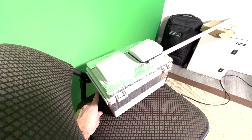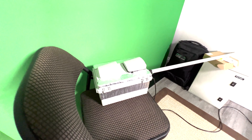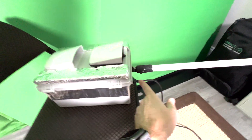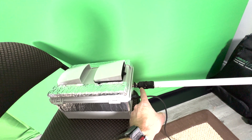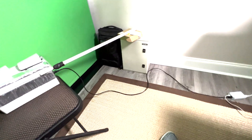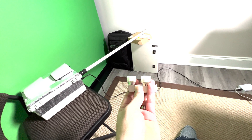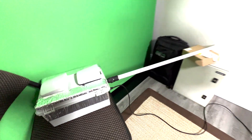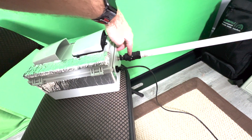That's assuming you don't mount it in a shaded area, but for me these are on telescoping masts so they're literally just up there. On the later builds I've done all the holes I drill on the bottom, then I use LMR-600 cable and just come around and go up to the antenna. You can get 90-degree N-type connectors, but remember for every connection you're losing a little bit of signal, so you really want to keep those connections and junctions to a minimum. So that's the exterior: the N-type bulkhead for the antenna cable, and the ethernet going in, which is POE.